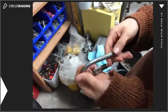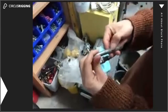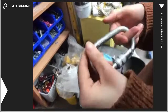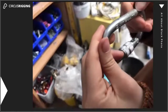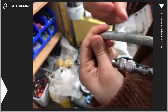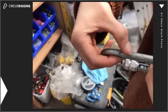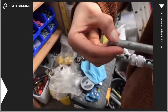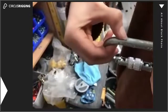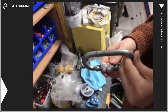So have you picked up anything which you think might be a loss of material? No, it seems smooth apart from just the... Yeah? Okay, so is that all the same? It looks to me, just there, is that not a transverse groove cut into the metal? That's what it looks like. It looks like a definite mark. Can you not get your nail stuck in that as you drag it round? The other end? There, keep going. That stop just there. What's that mark? There's no indentation. It's smooth. Okay, it looks like somebody's hacksaw line in it. Cool. That's all right. Now hold the carabiner up and see if there's any twisting.